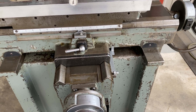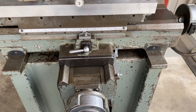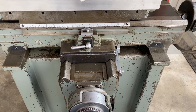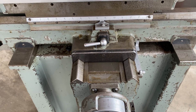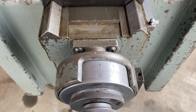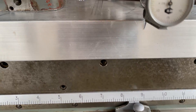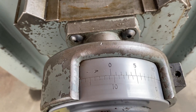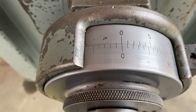It's not the ideal machine to do this particular operation, and it's not a new machine either, but like I said, it's budgetary. The machine has a relatively small table and it has lead screws with a really fine pitch to them, so you're going to have to do a lot of cranking — that might be the only downfall of this particular setup. We have several other uses for this mill in combination with our rotary table.